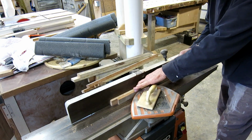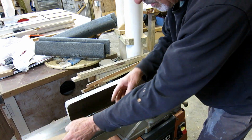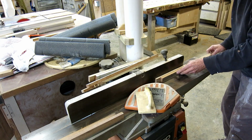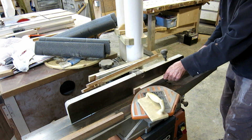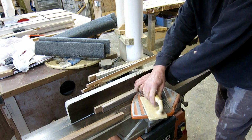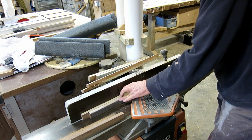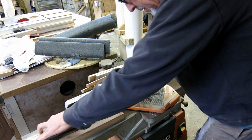After the glue was set, basic carpentry here, I jointed the edges. I ran them through a thickness planer, got them all the same size. And then with the router, I routed the inside edges because I needed to do that before I glued it together with the screen inserted. And in order to insert the screen, I ran a little groove around the interior with the table saw before it was glued up.